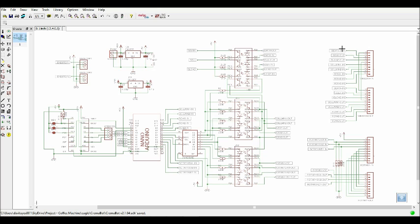The fact that we are running a 74HC595 inside the display unit probably means that there's a 5 volt or a close enough to 5 volt supply inside the machine, which I can probably tap off. There's also a 12 volt power or voltage regulator. The idea for this is to drive a stepper driver. So I haven't mentioned the stepper driver before, but the idea here is that I want a stepper driver to be able to move a conveyor system in front of the coffee machine.